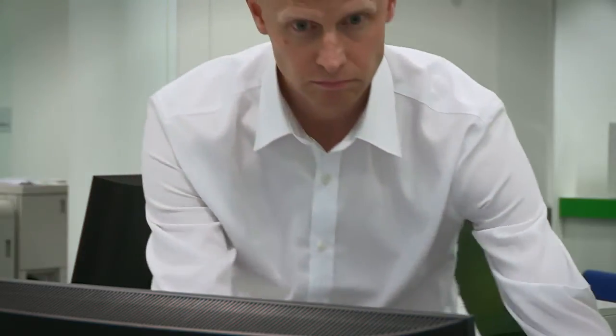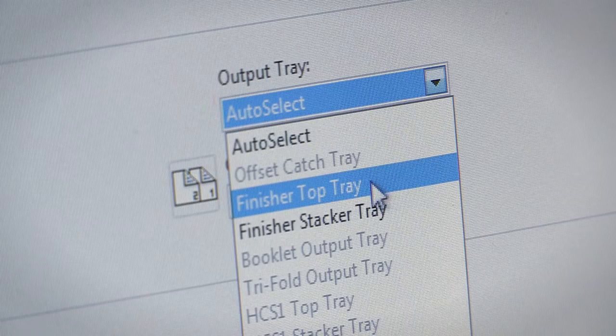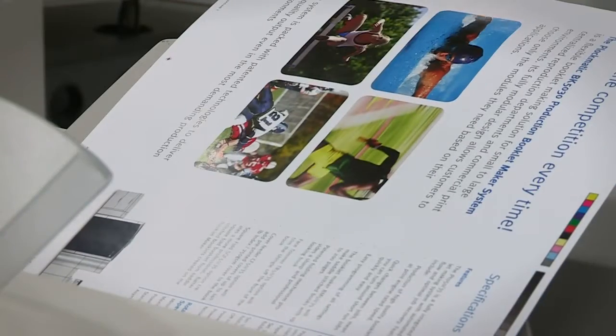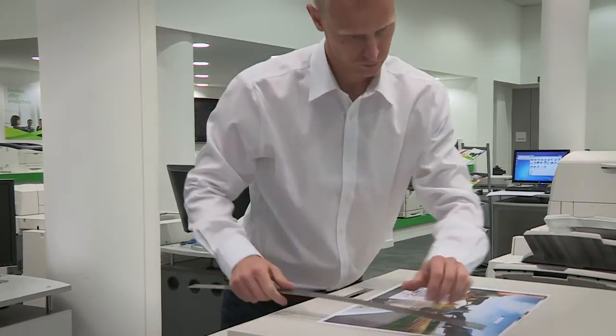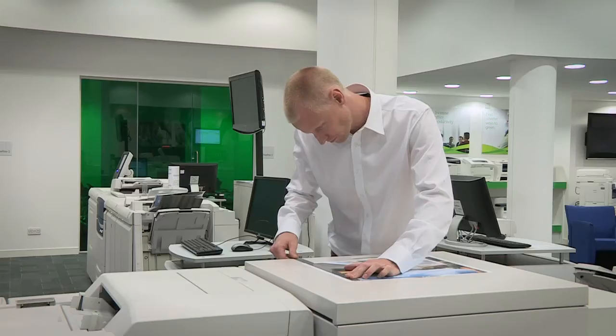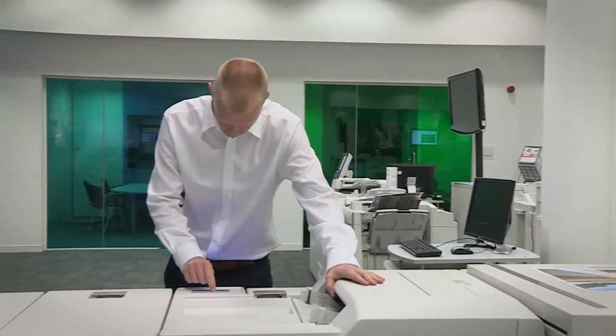As a recommendation, you may wish to make a test print of the cover stock used for the job and send it to the top tray of the printer. You will use this to determine if there is shrinkage of the cover caused during the printing process. This will affect how you calculate size and setup for the booklet making system.